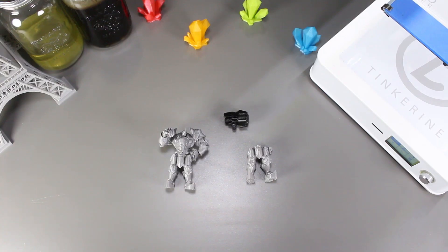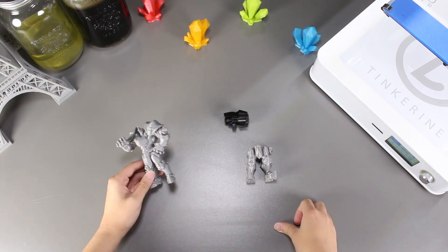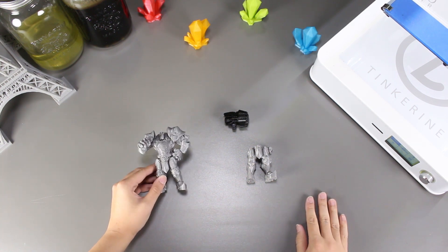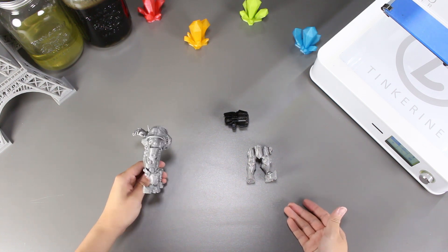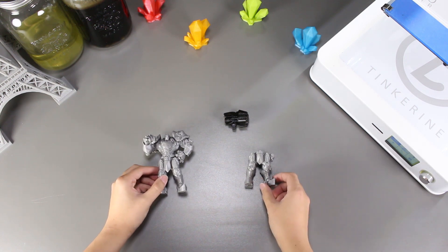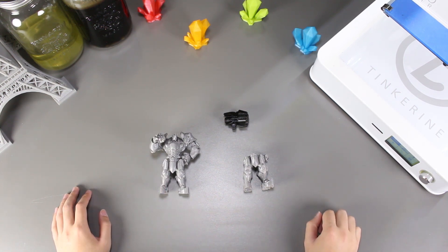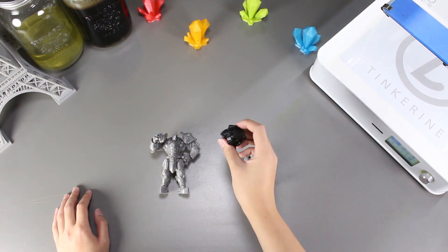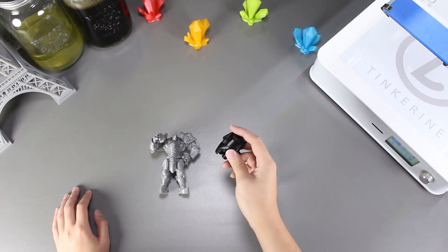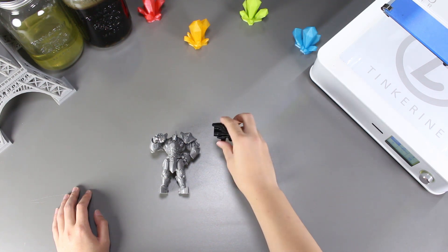Well there we have it. We tried removing support inside hot water. From what I experienced, I would say it is a lot easier and some parts did come out a tad cleaner. You don't need to use pliers and can just rip it off with your hands, and you don't have to worry about sharp edges as the plastic did soften up a bit. As for the heat gun, it doesn't look like it works — I can't gauge when it's an appropriate time where it comes off relatively easy.